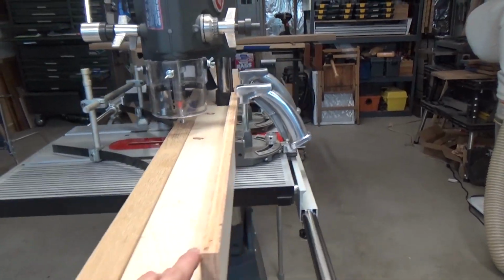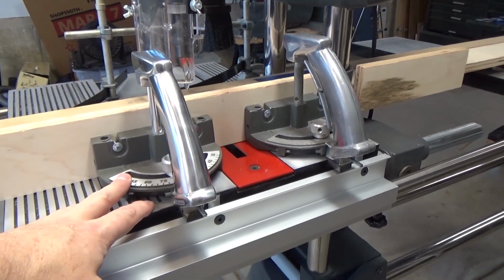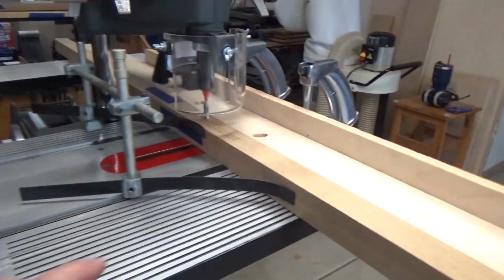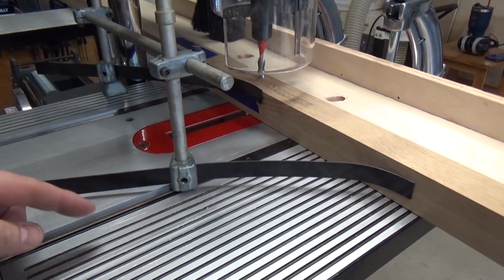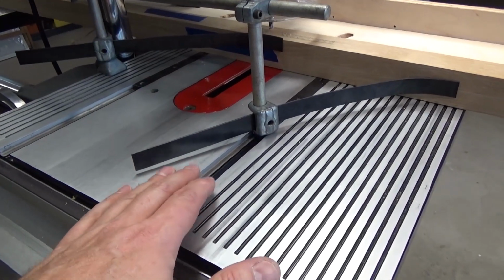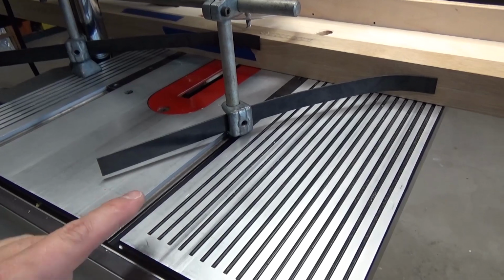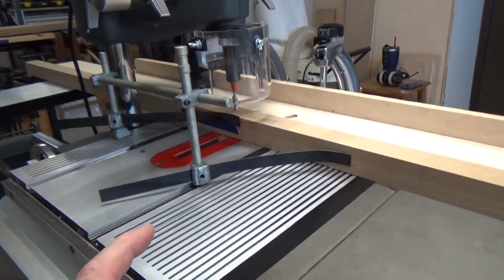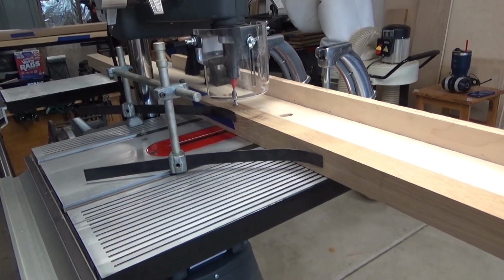I've built this auxiliary fence, and I've got it attached to these two miter gauges, which are both locked into the table miter slots. Then to keep the workpiece firmly against the fence, I can't use my traditional feather boards because they're not pointing in the right direction. The traditional feather boards are meant to apply force perpendicular to the slots, and I need to apply force parallel to the slots. So I'm using this old spring steel Shopsmith hold down system, and I did do another video on that. I'll link it in the description.